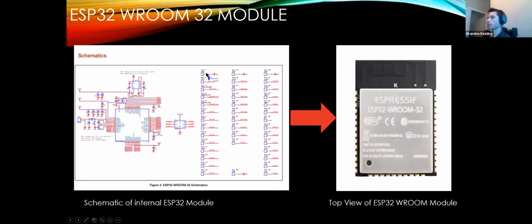And again, like I was explaining earlier, with the schematics and net names, he's separated all of this so he doesn't have a bunch of lines spanning out in every direction. So this is going to be a lot cleaner and neater, and you can see the net names on each line denoted in red. The blue squares that he has are just raw pads. They're going to organize these however they see fit, but it's describing these little half circles right here, and they each describe a pin on the ESP module.